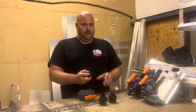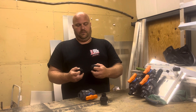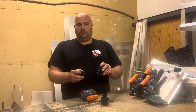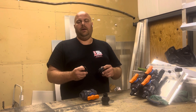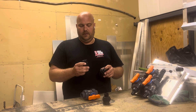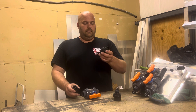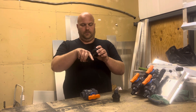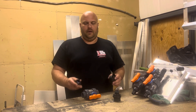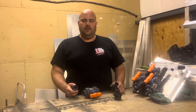You can take any of these check valves — this one is a one PSI cracking pressure. It is also a flap style valve but has a substantially higher resistance, just in what you notice with your fingers. That two-thirds of a pound pressure difference is something you significantly notice. You can blow on this valve: this valve is meant to flow this way and there's a substantial amount of resistance. With this valve, it's very little — no real effort.